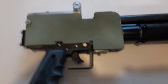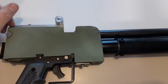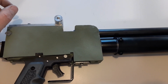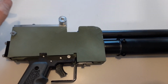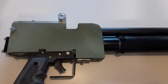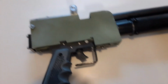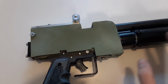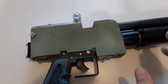And the other thing was initially, filling this thing, even though it's only 260 cc's, I think. Filling it was a nightmare because, back to the whole dwell idea, I wanted to use the lightest poppet valve spring possible, which is the spring that's holding the poppet on the seat. But when you do that, unless you have a big SCBA tank and you're filling instantly, if you go to fill with a compressor or hand pump, you don't have enough pressure on the poppet to fully seat it. So when I was filling this, turn on the compressor, all hooked up, and there'd be bubbles coming past the poppet until I got to about 1500 psi.